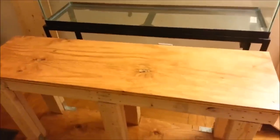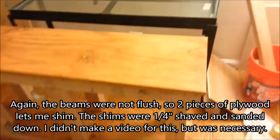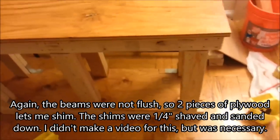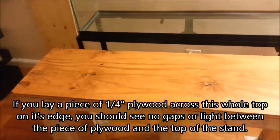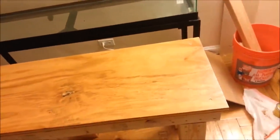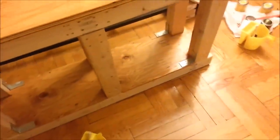Here's how it looks with two pieces of plywood - I've stained it and put about three coats of polyurethane on it, and also polyurethaned the bottom. Basically you stain it, then use 220-grit sandpaper after it's dry, put about three coats of stain on, and then apply polyurethane - wait 15 to 30 minutes between stain coats, but for polyurethane you need to wait four hours; you might as well wait a whole day. Three coats should be enough to make it somewhat waterproof.